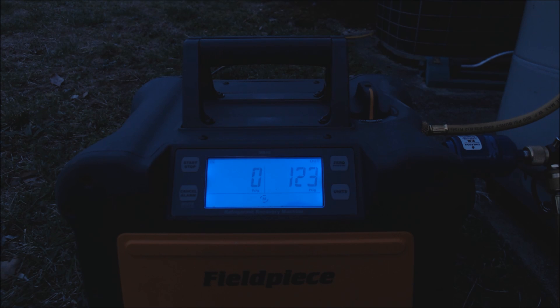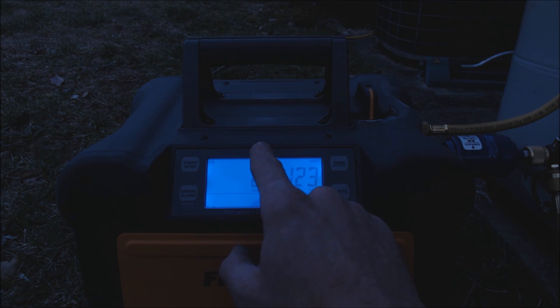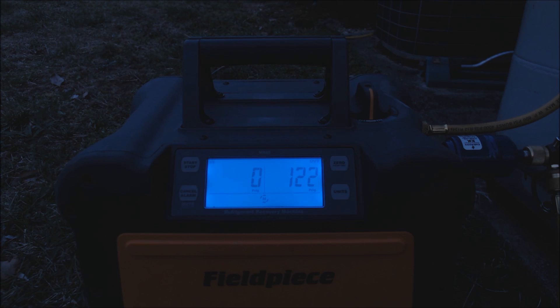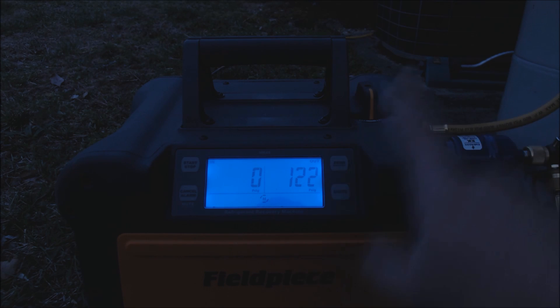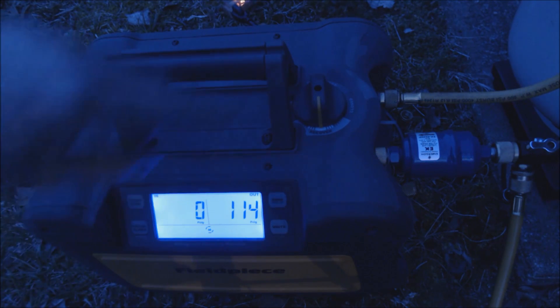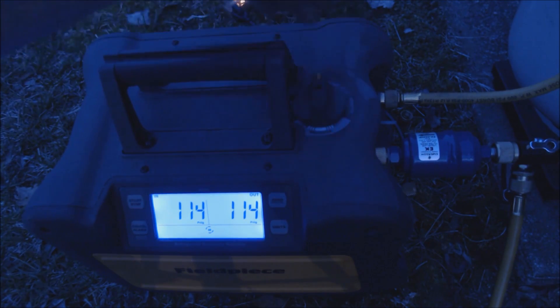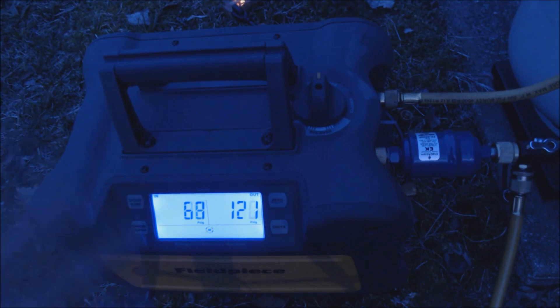That second pass amounted to about 1.3 ounces of refrigerant from when it was at 13 to 14 PSIG down to zero. I'll let it sit again — it shouldn't rise this time and should stay at about zero PSIG. It's very important to have the fan running on the inside, as that puts a heat load on the internal coil, which increases pressure on the low side of the system, making it easier to recover refrigerant into the tank. We're at zero PSIG — I'll switch to the purge setting and turn the unit on again, and this time we'll let the recovery machine shut off by itself.